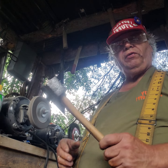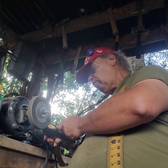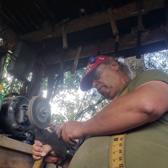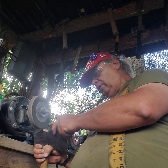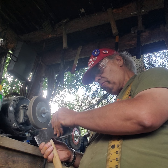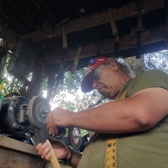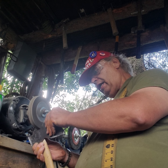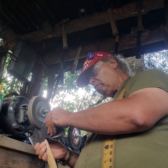It's a 100-year-old hatchet and it's just going to look good. We've got a wedge here — just a cheap wood wedge — that goes in the slot. We'll mark it and tap it with the chisel here and cut it in half. We only needed half of it. You can make these wedges, but I found them at the local shop for about 18 cents a piece. We'll put a little wood glue in the slot.